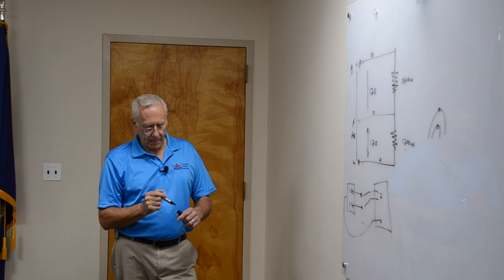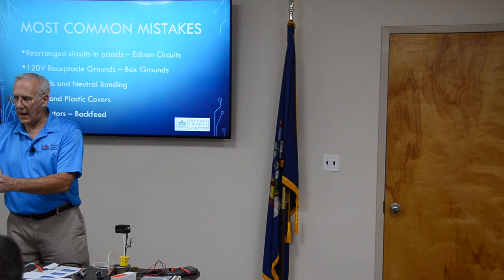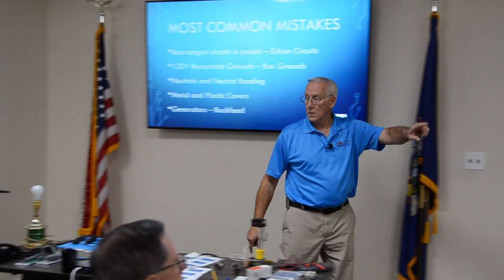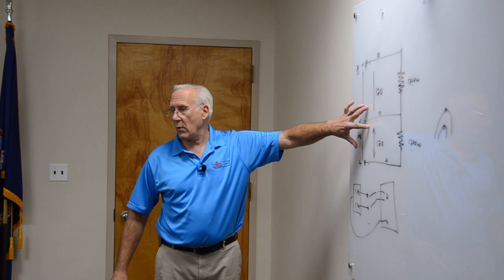Yeah, well, don't forget you're breaking this tab. You see this little tab here? You're breaking that tab. So that one terminal is the top and one terminal is the bottom. The neutral we're leaving alone because we only have one neutral. So you get twice as much? Yes. And this is in your schools. I've seen this 100 times. These circuits are very common in industrial applications, schools, factories, because they can get a lot of power with just three wires. That saves them.